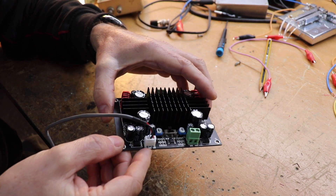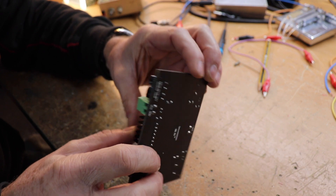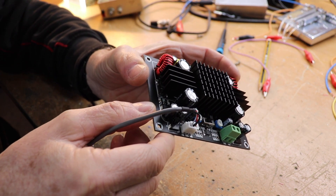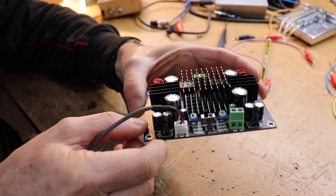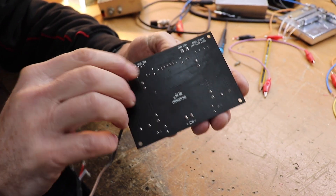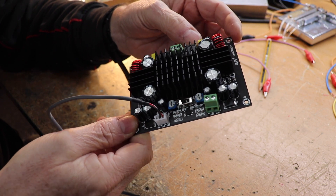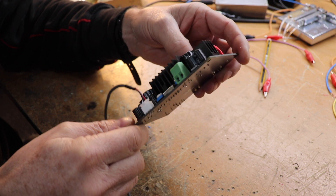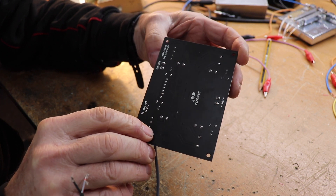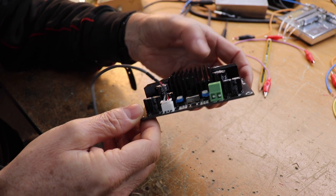Just having a look at this in more detail, I'm not quite sure exactly what the audio amp chips are in here, but I think they're these — I did manage to glimpse one or two of them. It's got quite a hefty heatsink on top and all the other semiconductors are covered with this big chunky heatsink. The PCB seems to be relatively well made, looks quite good, and a lot of the components are SMDs as you'd expect. From what I can tell, this runs off 12 to 24 volts input.